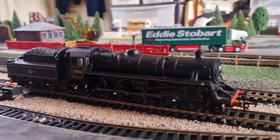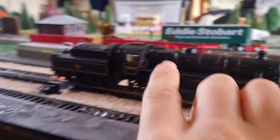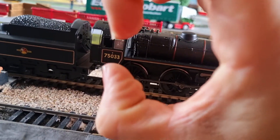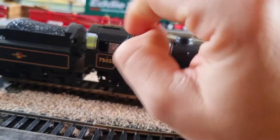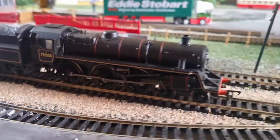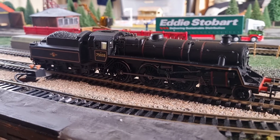However, there is one small problem: when it's stationary and you're running a current through it, it starts to smoke on the brush end. So you've got your motor, you've got your armature roughly here, over your gear train back here, and you've got two brushes which touch a very tiny commutator. When you run a current through it, it very faintly starts to smoke — but once it's running it's fine. The commutator looks relatively clean and the coils look okay, so I don't think the motor's fully kaput.